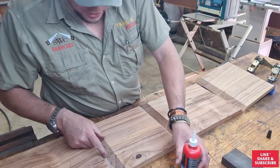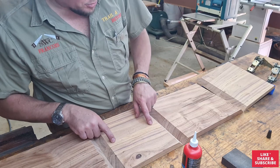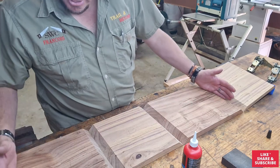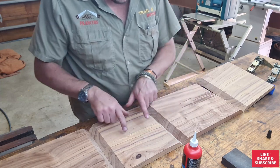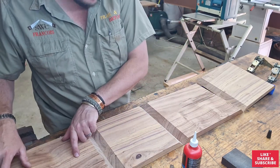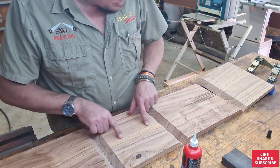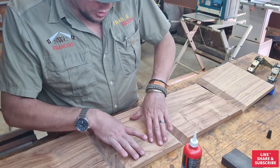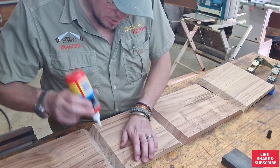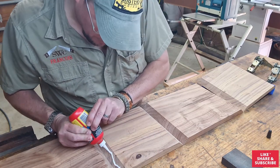If you measure your corners and you are a bit off, you can decide if you want to leave it or recut all the miters. But this is really perfect — you have a perfect miter in the corner, that's what you're looking for. Before I start with the glue up, I lay my ratchet straps out on the desk and move them underneath my project. It's always a good idea to get everything ready before you apply the glue.